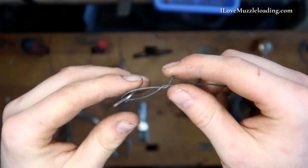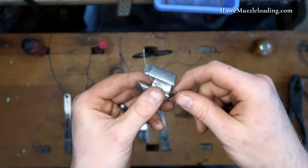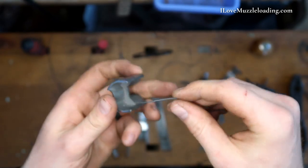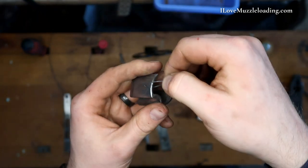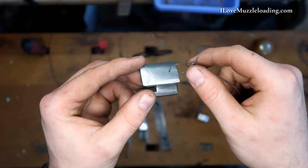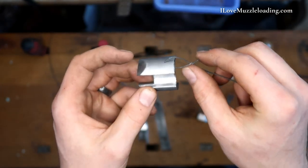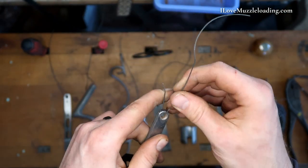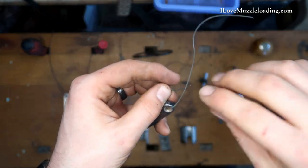I'm just doing one simple twist of my wire here — I don't want this to be a pain to get undone, but I don't want it to come undone on its own. For our nose cap, we have pinholes we can go through. As long as I make a wide loop like that, we don't have any contact between the wire and the surface that's going to be browned, so there shouldn't be interference with that finishing process. On some of these parts, make a nice wide loop and you should be good to go. On our barrel tang, we can kind of hide the wire and any potential interference inside of our countersink there for our screw or bolt, and that will hide any interference from that wire.